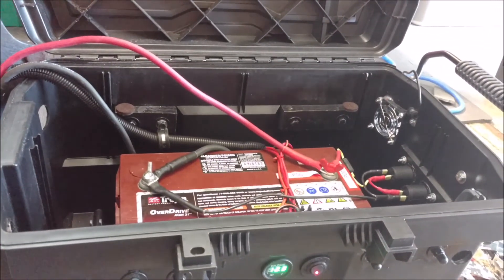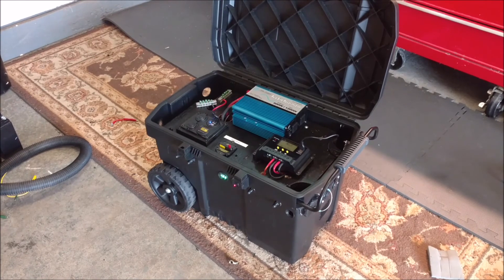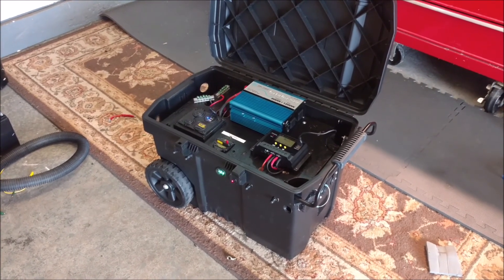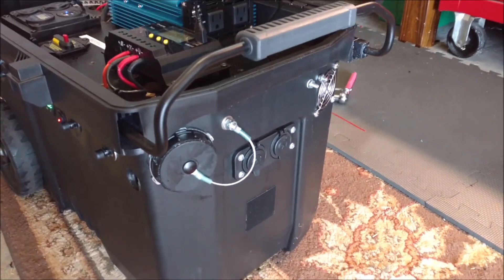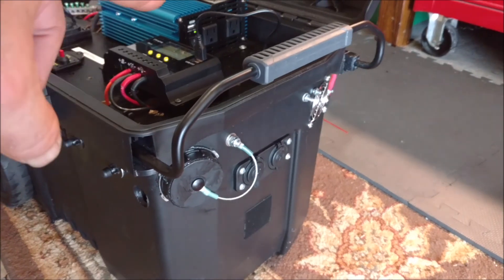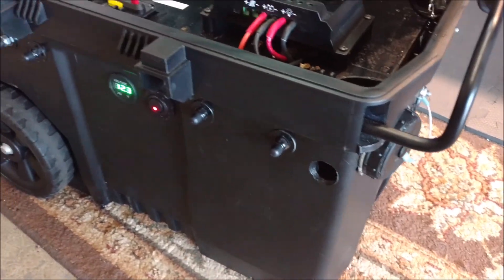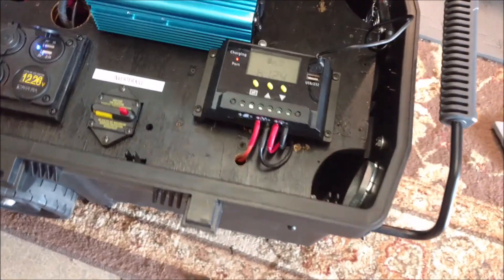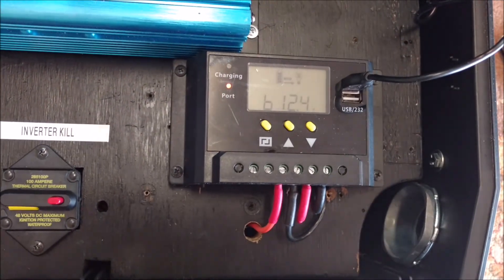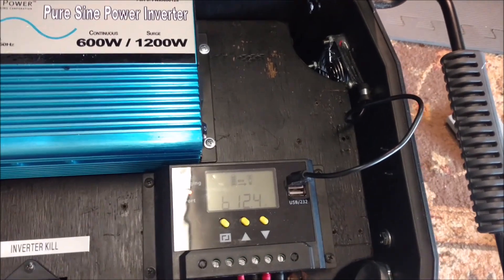You can see the Trojan in there. There's a blower fan up on the right. Here's the power tray back in place. I've got the USB blower fan connected there, though I don't like it there - I'm going to get an extension cord. I also have a receptacle in case I want to run a utility cord. The switch will kill everything on the load side, connected to the load side of the solar charge controller. When the battery gets too low, it shuts off anyway.